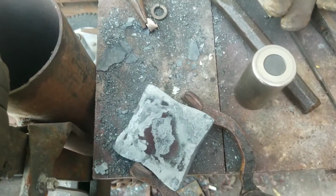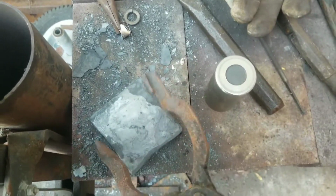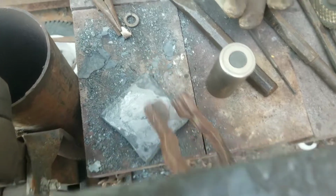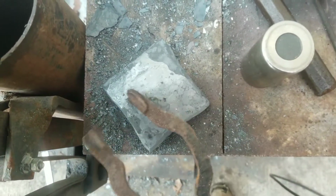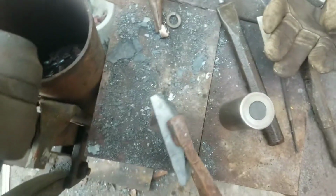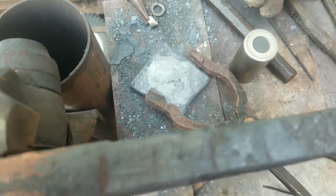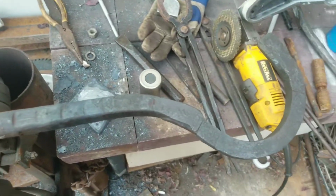It's almost like a star pattern with a bowl. There are four facets in it. I'll weld that up in a little bit. I did grind out some of the cold shuts that I got from that hole that was in it. I think you guys saw that. But I'll put this in the mill and get to work.